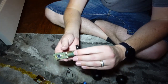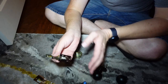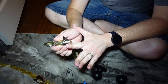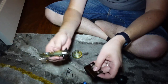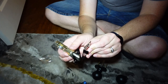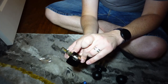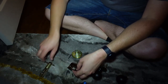Alright, so when you're putting these things up, you do have to make sure that you put your striker the correct direction. So when the door shuts, it can go through and get into the little locking position. So, that's how these work. It's just spring-loaded. So you shut your door, that comes across, gets into the pocket, and goes through, and now it's held in place. Pretty simple.